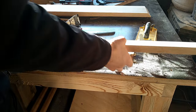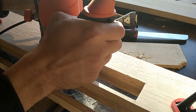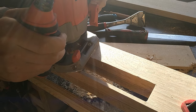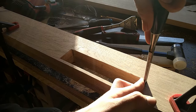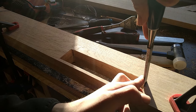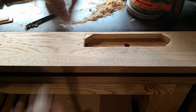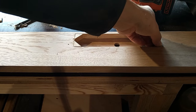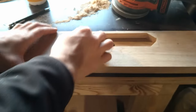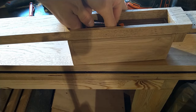To make the top piece similar to the bottom piece, I used a template bit and went the opposite way around the hole. Since oak splinters so easily, I thought a climb cut might help — it ended fine and I was well aware I needed to pay attention to the router since it could run away. To hold the lid, I made tiny triangle pieces for each corner, using the lid upside down as a spacer to find the right gluing position. To mount the box, I put a screw in each end — one going into the leg and one into a small block I put next to it.